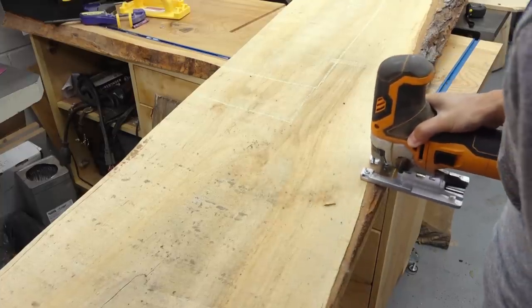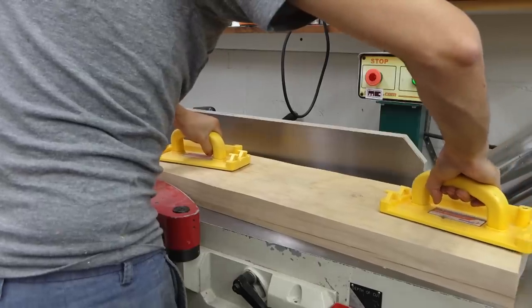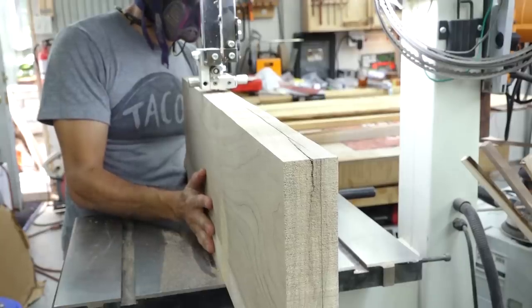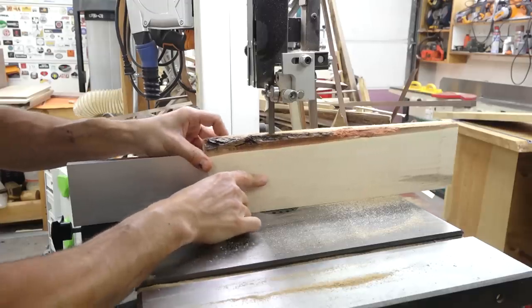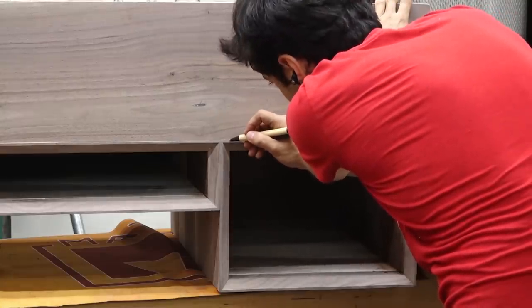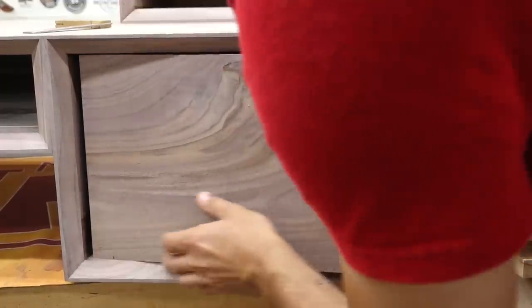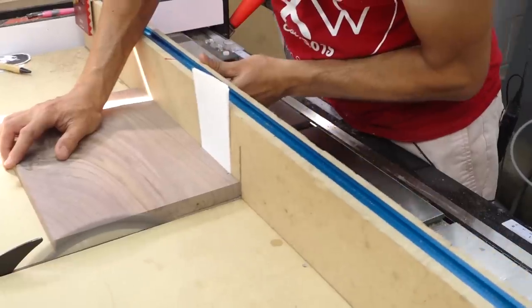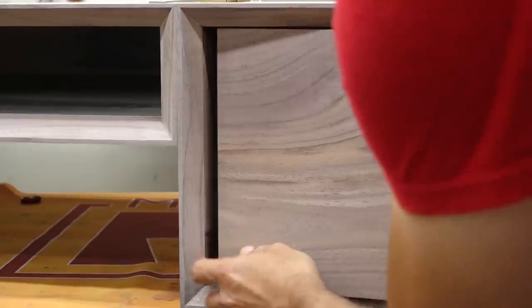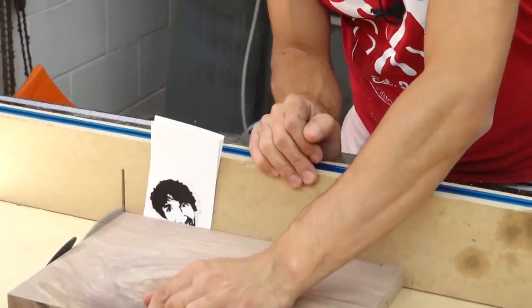Next, I can start working on the five drawers. I still have all the stock for the drawer boxes in rough sawn form, so I'll run through the process to get the stock I need for the sides, backs, and bottoms milled up and re-sawn. I'll set that stock aside for a bit and work on cutting the drawer fronts to fit their openings. I'll start with a square cut and check that against the opening, then adjust the cut angle with some shims until the cut matches the opening with no gaps. Once I have one end, I can repeat the process on the other — cutting it a bit long, finding the angle, and then cutting it to final length.